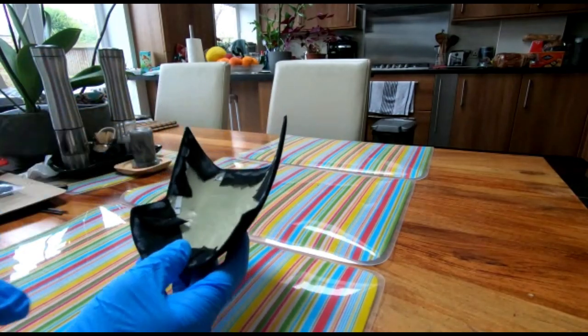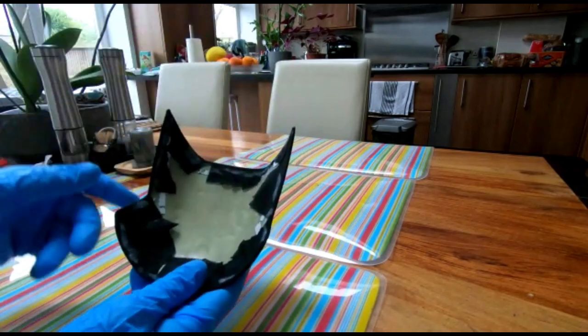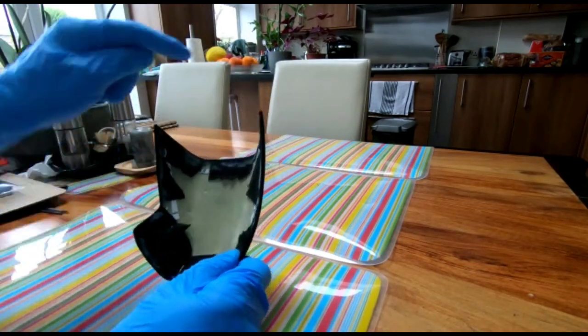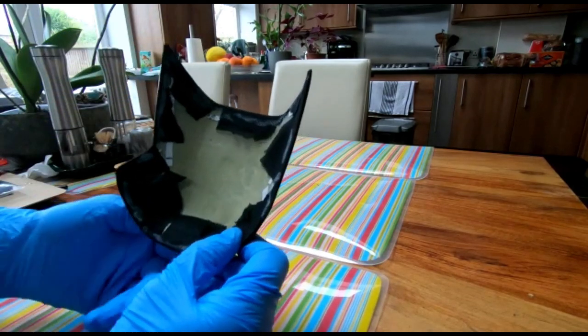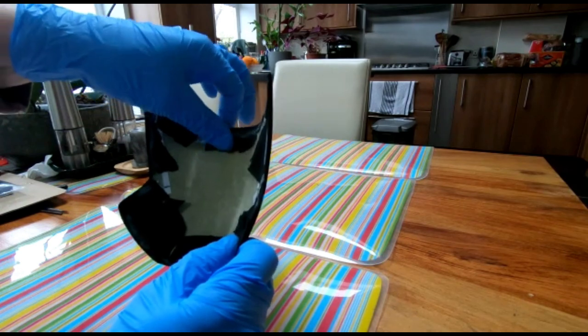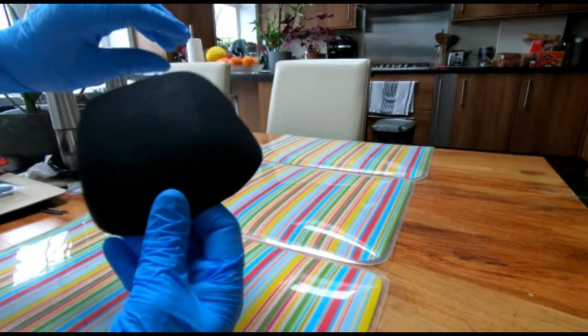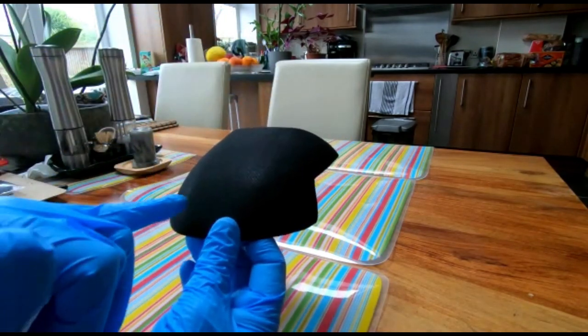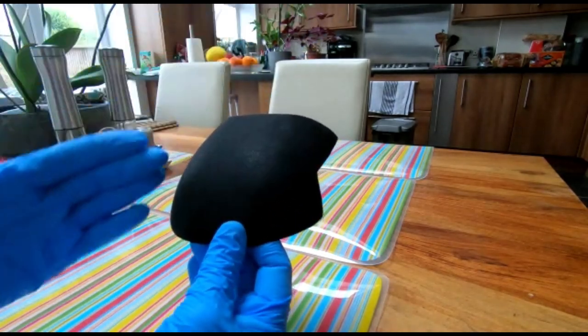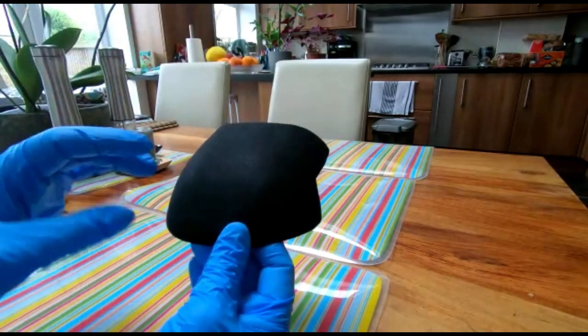And then you've got a square of mesh underneath that, and you'd make a cut there and a cut there, and stick that on, stretch it all the way around and stick it onto the double-sided tape underneath. So you make sure it's all stretched, and you make sure it's all in line too, so all your lines are perfectly lined up before you actually stick it down.